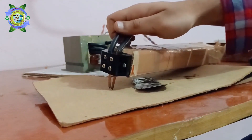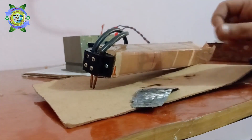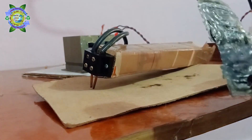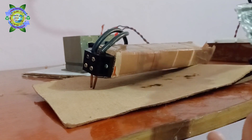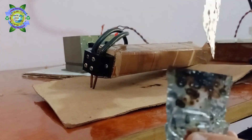This wire is also getting quite hot. You can see it's not quite a good weld. I think this is because of the transformer — this transformer is not giving sufficient output. The rating says 800 watts, but perhaps it may not actually be 800 watts. It's Chinese, and I checked it — it has aluminum coils — so it's not giving proper output, or maybe 800 watts is not sufficient enough for spot welding.